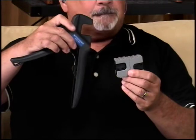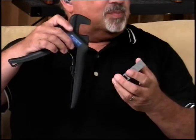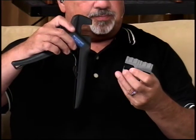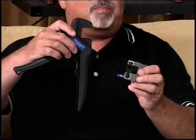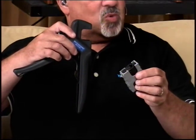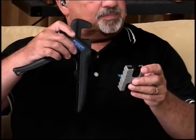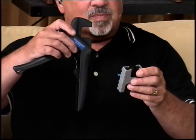And these dies are for standard, you know, butt connectors. Ring terminals. Right, ring terminals. Or you can get them for ferrules, or you can get them for some of the communications like RJ45, which is Ethernet, or the RJ12, which looks like a phone jack. But if you're familiar with our PLCs and whatnot, most of our PLCs all have an RJ12 connector for communications.